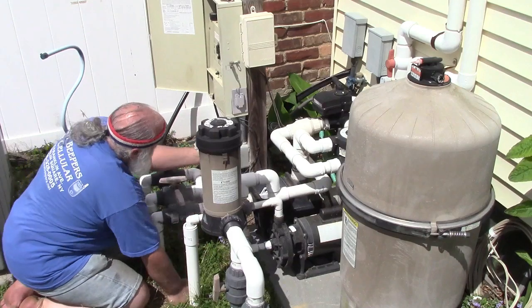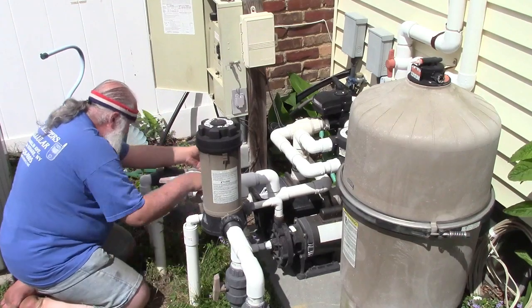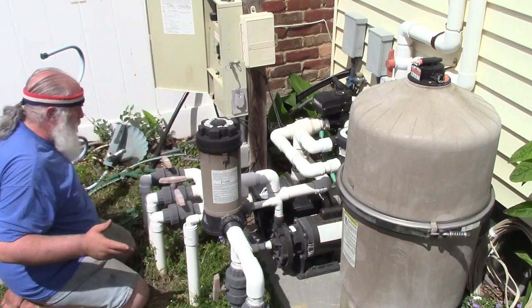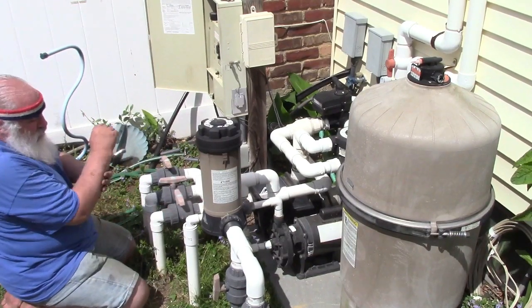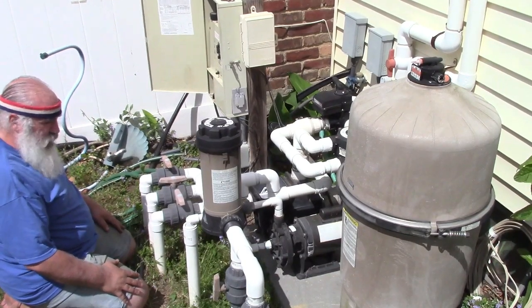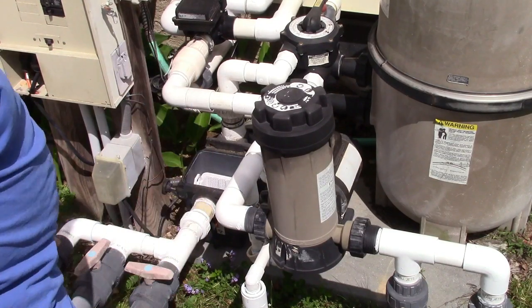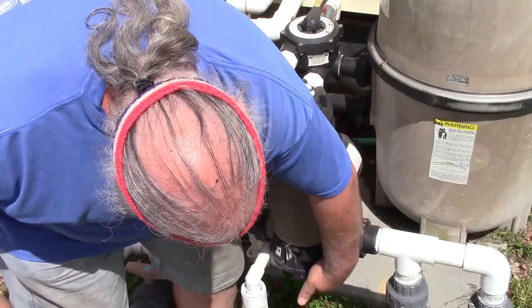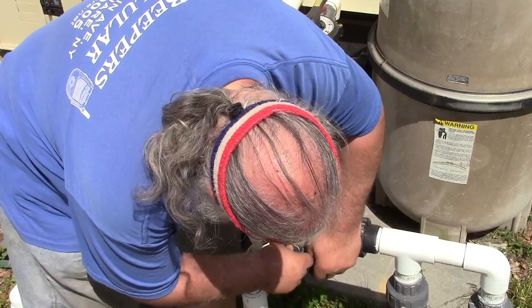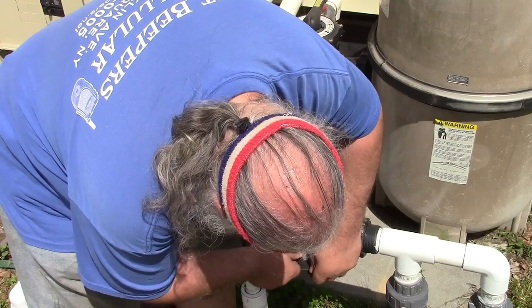Plug that in. Give that a twist. It's locked in. It's got a little slot for that. Closed? Never closes. Alright, closed. A couple other little pieces here. Let's reconfigure. Now we have to put in the plug in the chlorinator. Pick that up and screw it on in. Don't cross thread these things. They don't work too well that way. There we are.